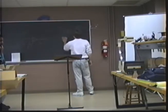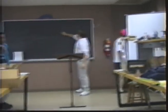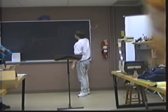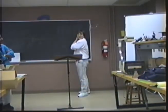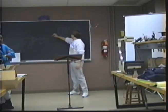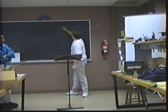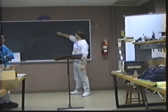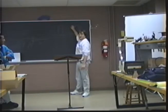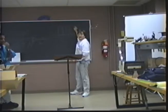The final use for the circuit is for counting the actual docking station. We can adjust this so it has a pretty far range. I don't think we've ever come up with what the actual maximum range is, but we can get several feet of sensitivity out of this. With the back, there's going to be a light behind us, a very bright one right here, and these will turn almost completely black. So if you set up a sensor to read about here, you can simply have it look for light and dark and count off the bases until you get to the one that your block is at.